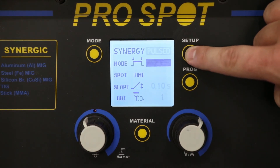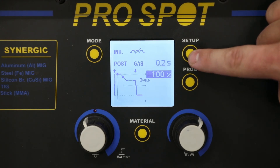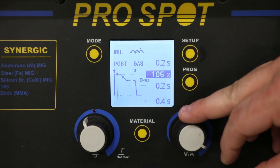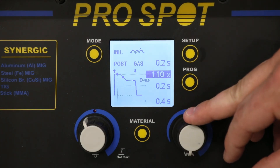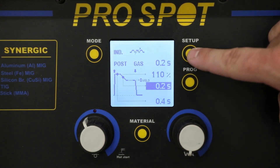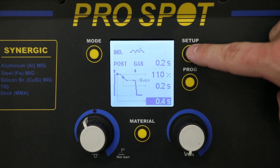Once the setup list pops up, we're going to hit the setup button to scroll down until the graph appears at the bottom. You'll see that right now it shows 100%, which represents the original welding parameter on the main screen. Anything above 100% is when the hot start actually kicks in. Once I go above 100%, it brings up two other time options. The first one is going to be the slope time for the hot start, meaning the time from when the hot start is completed until we're back at the original welding parameter. The bottom number is going to be the actual hot start time — the time that the hot start is engaged before it goes to the slope and back to the original welding parameter.